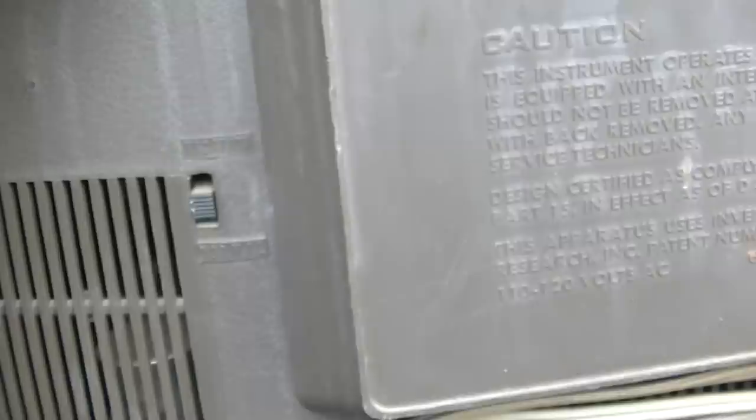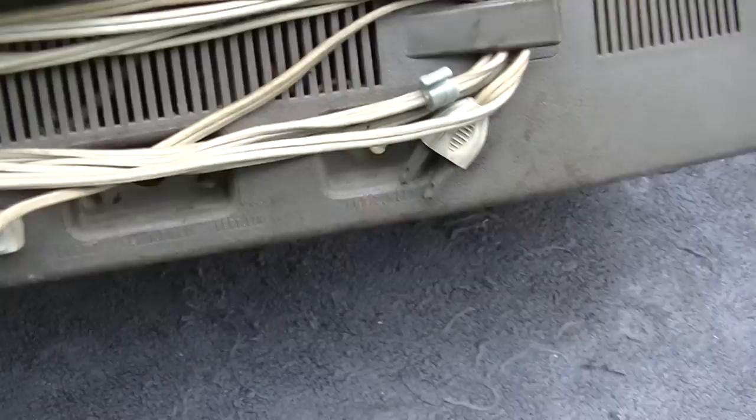Ooh, we have a vacation switch. Vacation or normal, so that's your instant on disable, your preheated filaments, which there's still a bunch of debate whether that causes the tube cathodes to burn off or not. So it's an MQ625. Let's grab our Packard Bell dealer's manual and take a look.